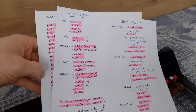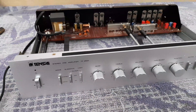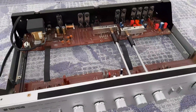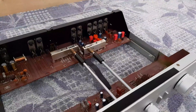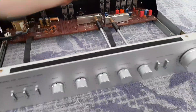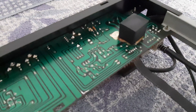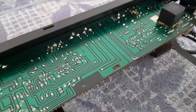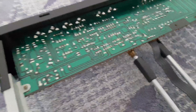This is the parts list I was using — here is for the amplifier, which is not the discussion on this video. As I said, for cleaning and restoration there's no adjustment needed — everything is self-adjusted. I resoldered all the cold joints, cleaned the board with isopropyl alcohol, and after that used contact cleaner for deep cleaning. On the front it looks clean as well.